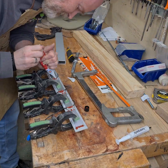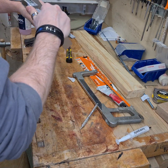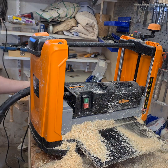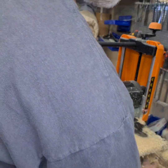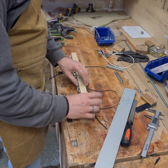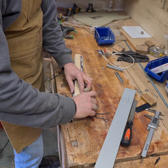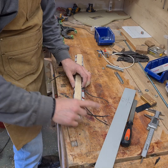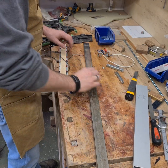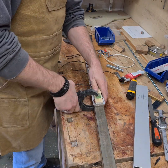It takes about 24 hours to cure, so by the magic of editing we will see the next step immediately. Next step: size the wooden filler to add stability and to make sure that the heat sink flat stock is pressed against the outside of the box. I also size the wooden filler so I can fit the leads and cables on the side to get them more or less out of the tool. I use a steel bar to keep things extra flat while the silicone is curing, to make sure it's flat.